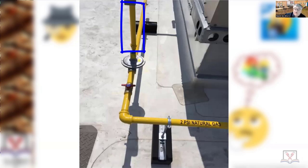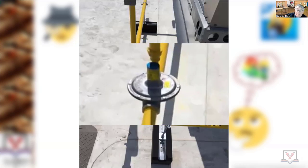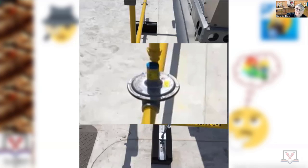One of the things you're seeing is a vent here. Hopefully you know why that vent is there, because that's a regulator. You're looking at two PSI natural gas coming in this way, and then after that regulator it's kicked down to a half PSI. There's a rubber diaphragm or a neoprene diaphragm right under there — that's why it's so big — because you have the pressure from the natural gas on one side of the diaphragm and atmospheric pressure on the other side, and that's how everything is being regulated through a little adjustment under that blue cap.